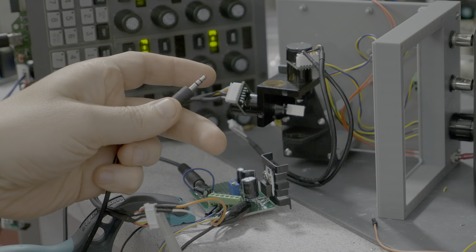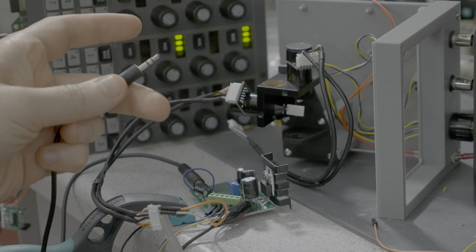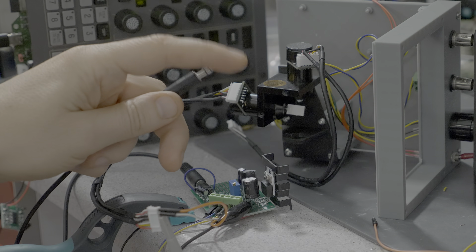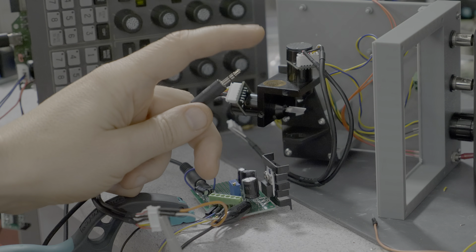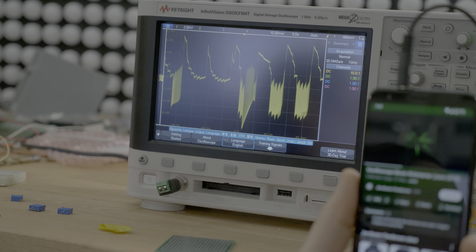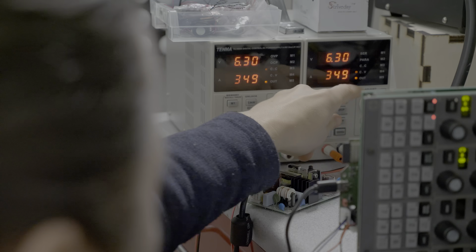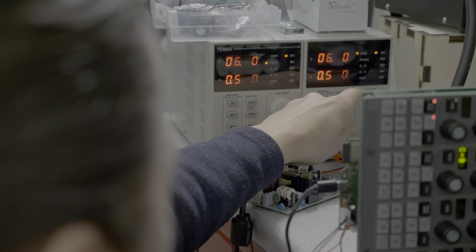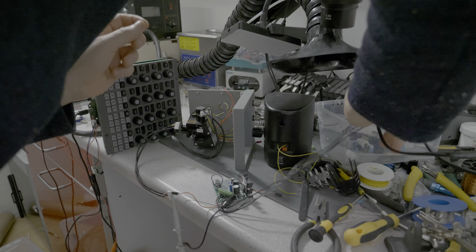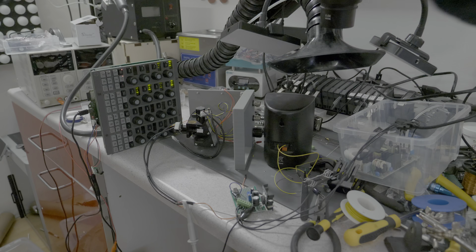My real goal was to find out if we can drive the galvo without a feedback loop. It somewhat works, but it would require a lot of tuning to balance all the physical attributes. We made a laser telegraph — as it is, the mirror was only maxing out to one direction or the other, which isn't healthy at all as I found out later. I need to turn it off — this will melt my galvo.